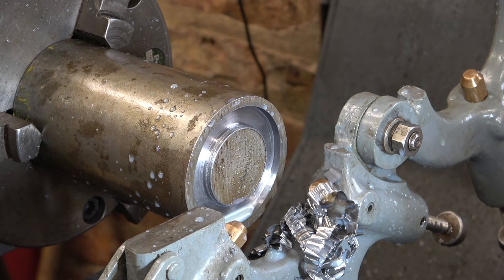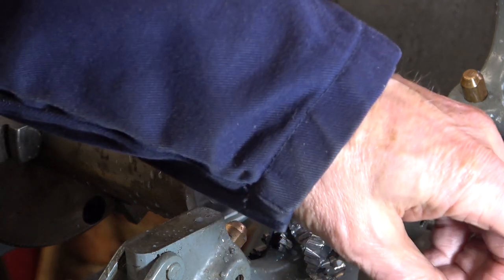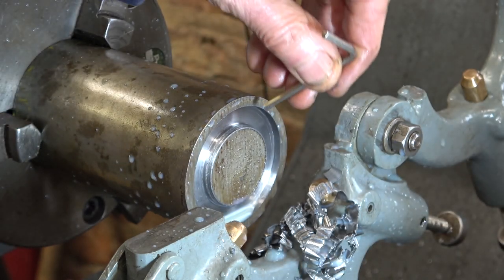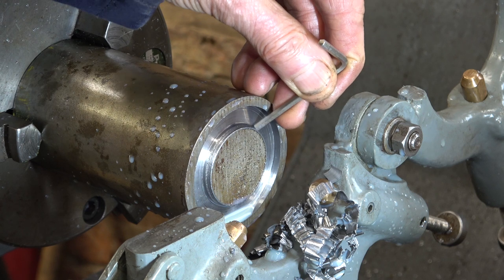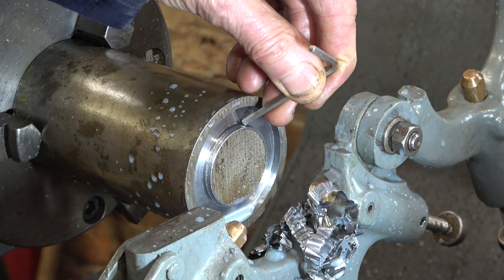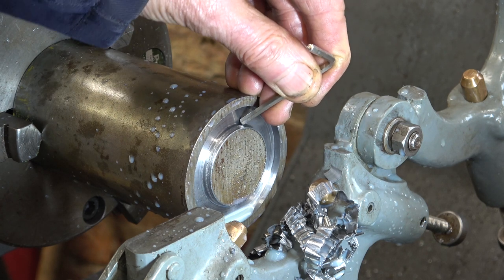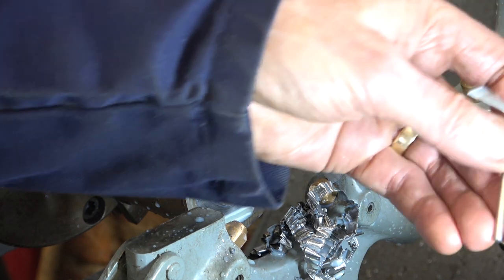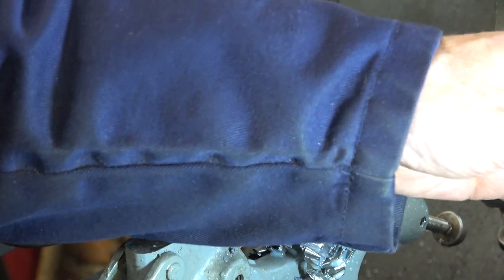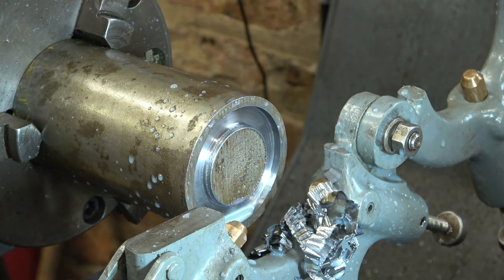But I think what's happening is, yes, I can see it. The inside of the cutting tube is binding on here, look. And that's acting like a taper, a lock, a wedge, and it's making it very difficult to force in. This is because the inner carbide doesn't go far enough across. I think if I was making another one, I'd be able to fix that.